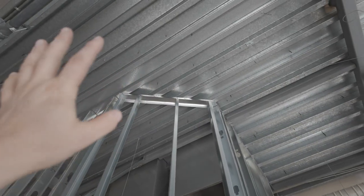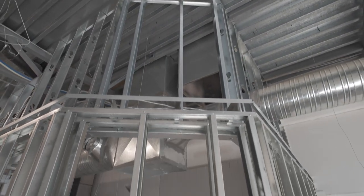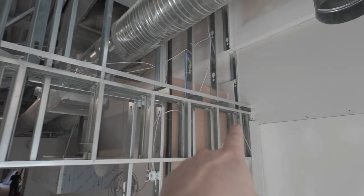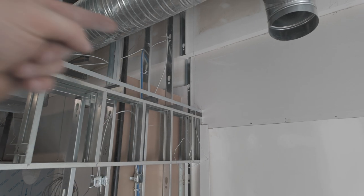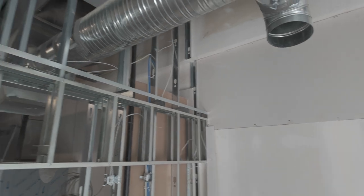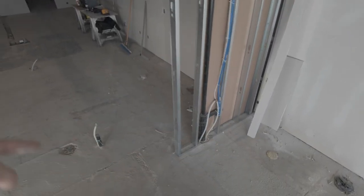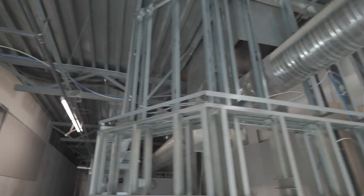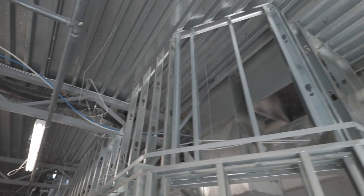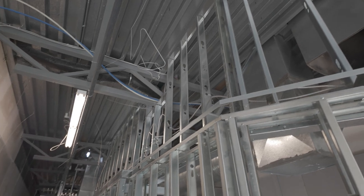You can see there's three bulkheads here - one, two, three, and the track pieces. I'm putting backing in right now, and same thing when you're coming off the wall - I'm just screwing the studs to the wall to secure my bottom track. I'm drawing my 16s - I even laid my 16s out on the ground so I can shoot them up. For the main bulkhead, between all the cutouts and cuts, I can shoot whatever one I want up. That's it!